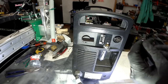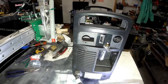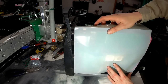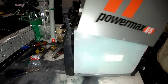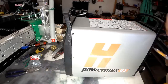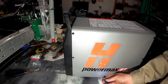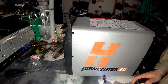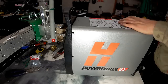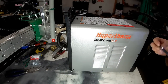Now that everything's wired, it's safe to go ahead and screw that in the back and lock it down. Now you just put it back together — get that plastic sheet back on there. There's a little peg on one side of the shield to help you line it up on the right side, and from there it's a home run. That's how you install the RS-485 field kit. It comes with good instructions. I don't work for Hypertherm — no paid endorsement — I just have an old Hypertherm I bought 15 years ago and have lugged around since then and still use it in the shop.